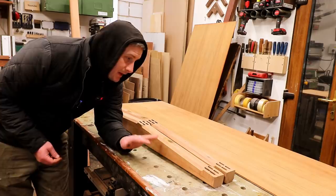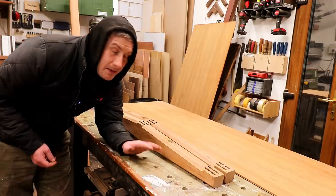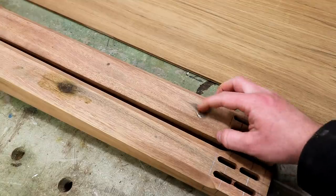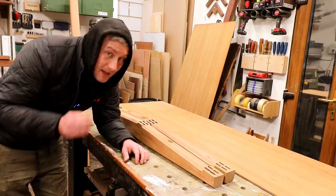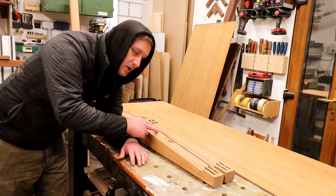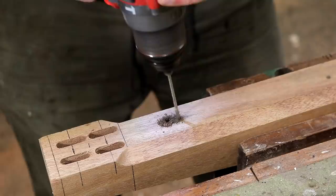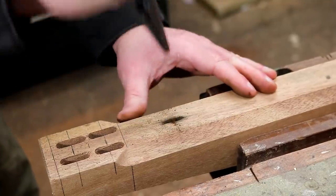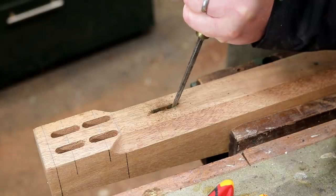I've now got all of the shaping done with the legs and all of the joinery cut for the footboard end of the bed. Testing with a magnet I can see that there are a few pieces of metal in here, but unlike the headboard end this isn't going to be against the wall, so I really do want to cut these recesses out — time to go digging for some metal. The footboard end is basically the same design as the headboard end, just shorter in height and with a housing groove to accommodate the panel instead of cleats.